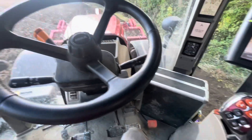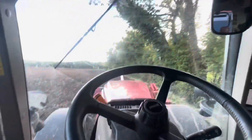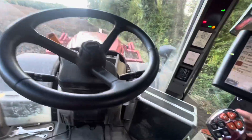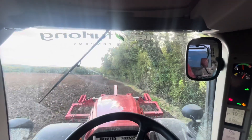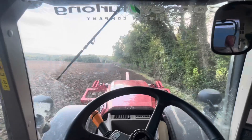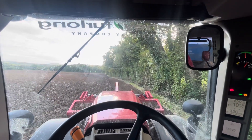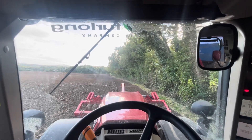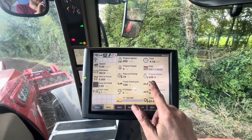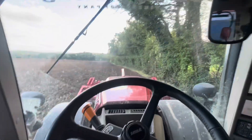Here's the weighing scales for the one-pass, and then the one-pass here behind me. Here's my headland management button — I have it set so it'll lift the front, then 1.5 seconds later lift the back, turn off the PTO, and lift the scribe. Press the button again, it lets down the back, turns on the PTO, lets down the front, and lets down the scribe. It's a pretty good setup — really nice tractor. It's only on 406 hours, so we are over the hours we were allocated on the hire, but we'll just pay that and keep going.